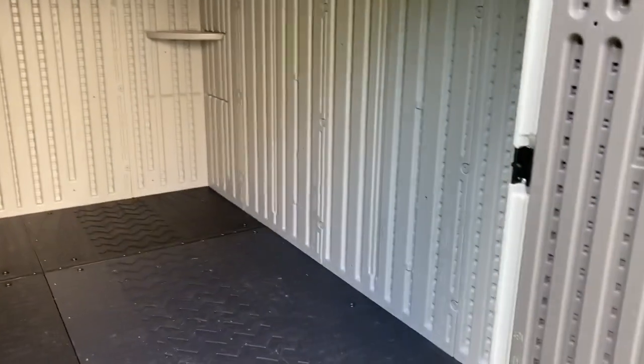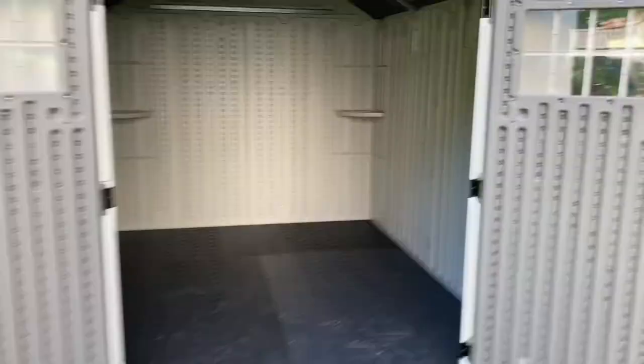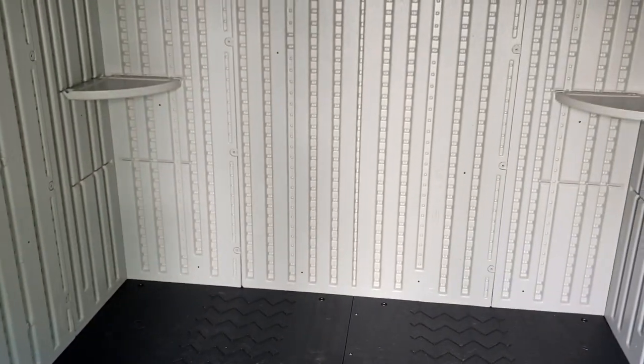There is no way to adjust the doors without shimming the whole building afterwards, so I wouldn't recommend bolting the building down to whatever your surface is until you are completely done. Go back and bolt it down afterwards because you don't know what you're going to want to shim. Make sure you have a rubber mallet to bang things around, but don't bang it too hard — if you kick these panels they will fall apart on you or dent.